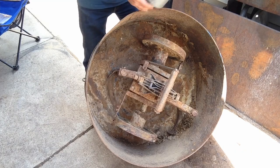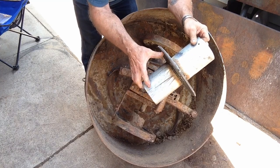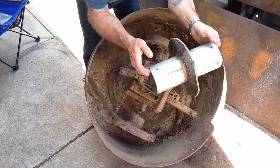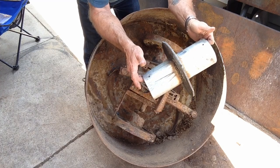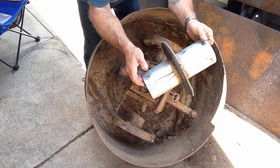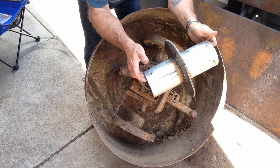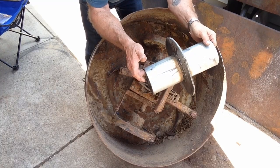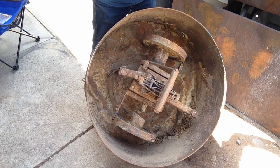We had a right-angle gearbox running into a sprocket via chain drive, but it just didn't have enough torque. I think the Steve Chastain design is a little bit better, so that's what we're going to go to. I've already got the center housing machined out and welded up. The next thing is to strip this drum out, get all that out of here, and do a little torch work on it.